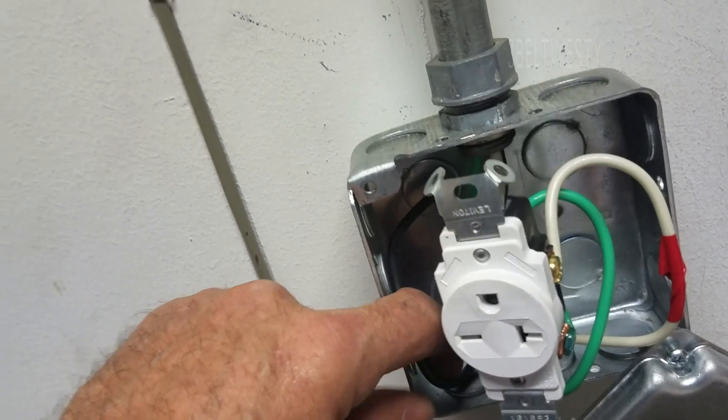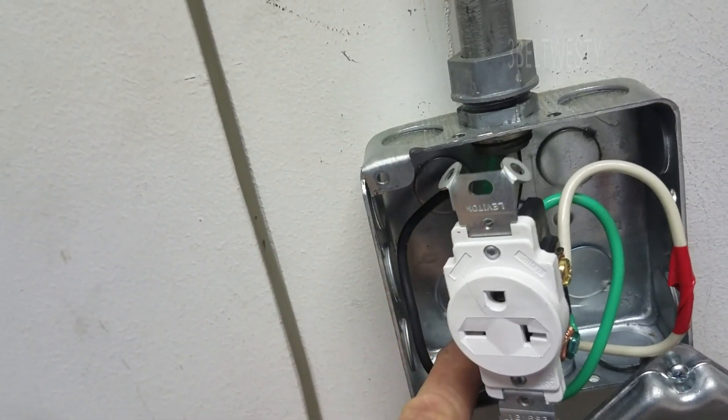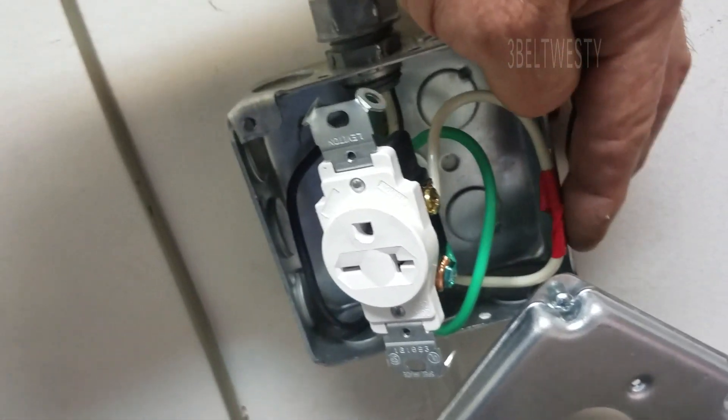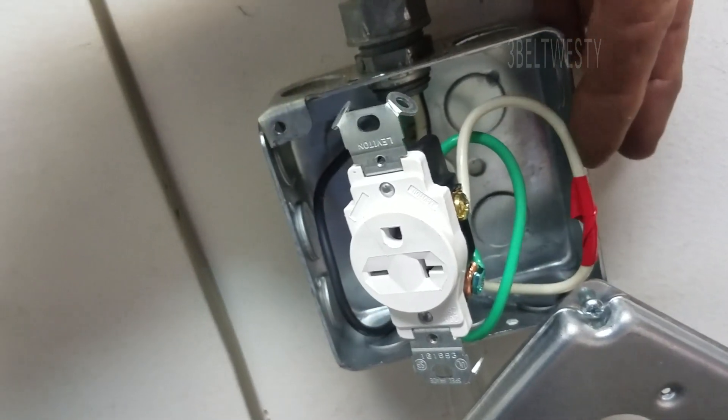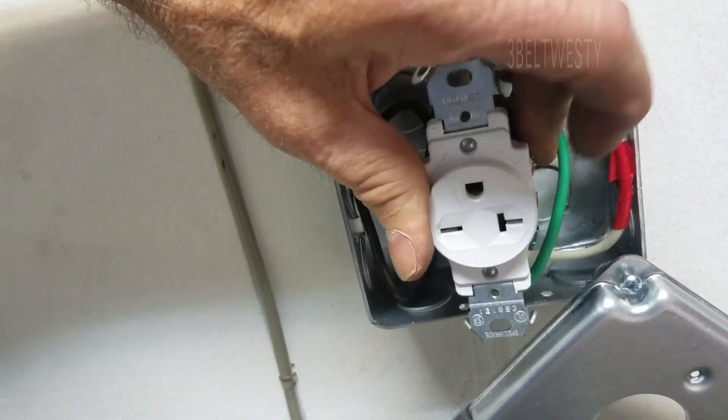This is 12/2 wire and 10/2 wire. I've marked one of them red just to let anyone know this is not a neutral or grounded wire — this is actually a hot. I usually put some notes in there for myself.